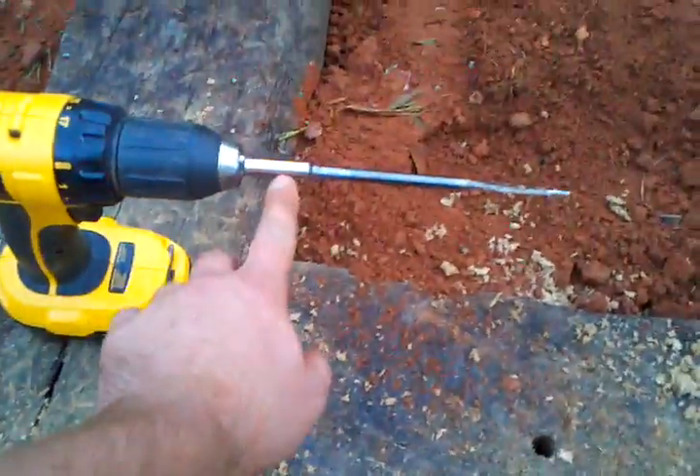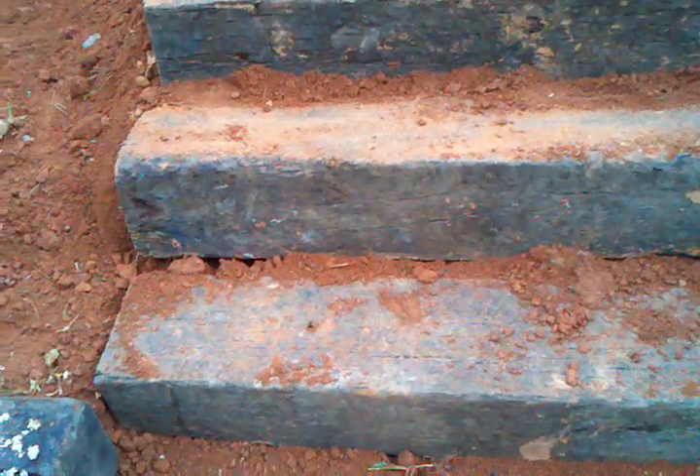I cut them to four-foot lengths, then I took my drill bit and used a five-eighths butterfly bit. I had to put a little extension on it to get it long enough to go all the way through. I came about a foot off each side and drilled a hole on each side through every one of those timbers, then took about a three-foot piece of steel rod and drove it down in there — about two and a half feet into the ground, with the rest inside the timber. That way it keeps them stable and they won't roll down the hill.